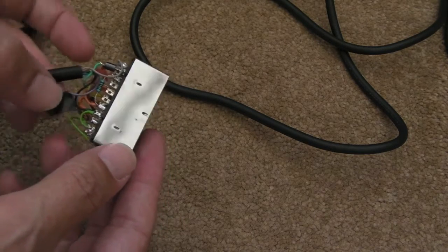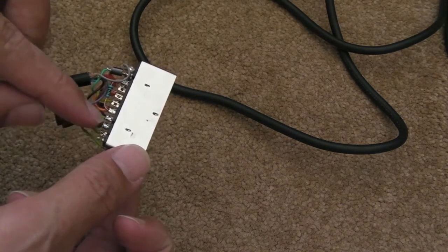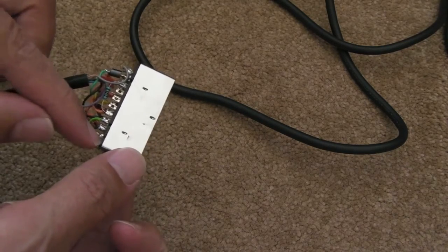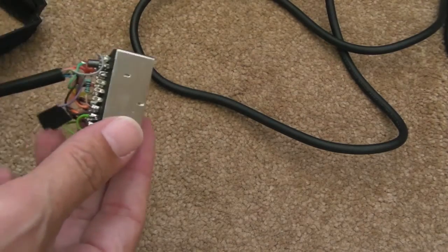I think it's probably connected to nothing, that pin. You're just getting noise picked up on it. So it's better to just have a jumper linker to the other channels. You've got one channel coming in with that black wire, and the green one just links it to the other channel to make it sound stereo, because it is mono. The channels are all mixed on the output.